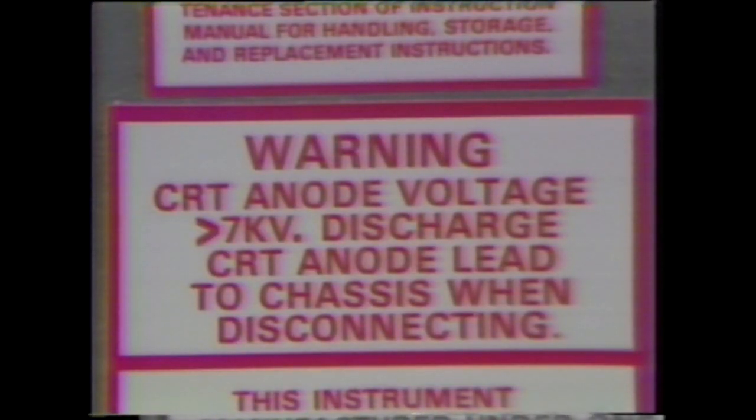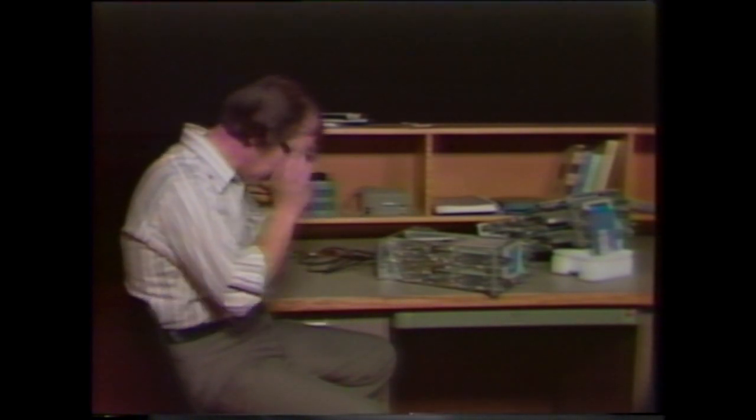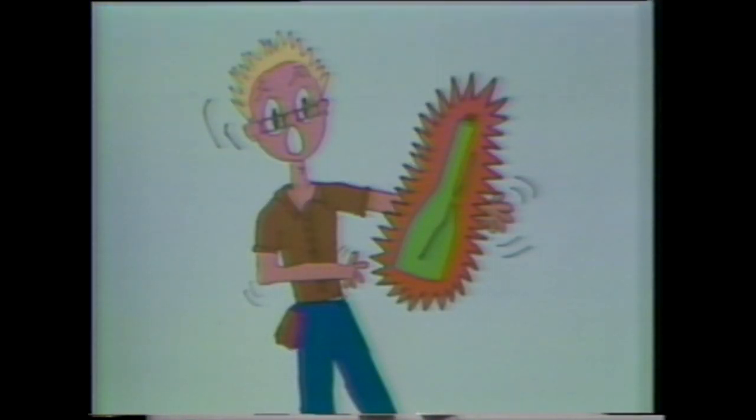Safety first. When it comes to changing CRTs, it's the most important thing to remember. Wear safety glasses and protective clothing to guard against injury. Before removing the CRT, touch the anode lead to the chassis to fully discharge the tube. CRTs have a habit of building up another charge after short discharges, so leave the anode lead shorted to the chassis for at least a minute to ensure full discharge. If the CRT isn't fully discharged, you may be shocked when you remove it from the scope, and if this causes you to drop the CRT, you could be injured by the implosion.